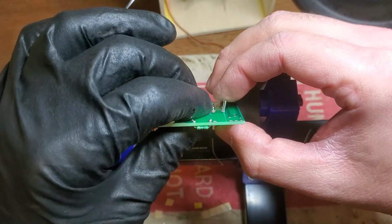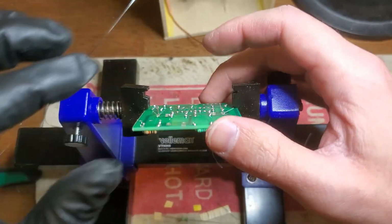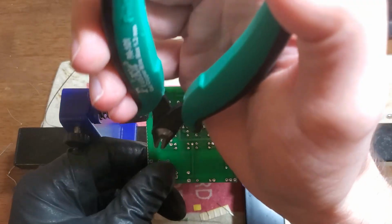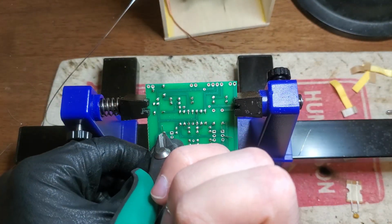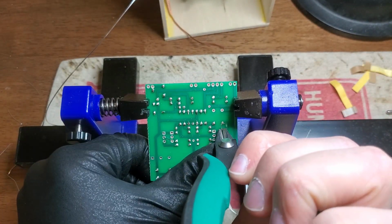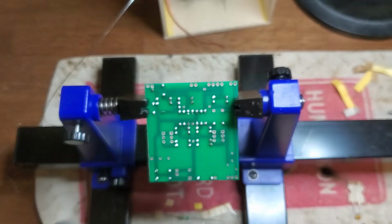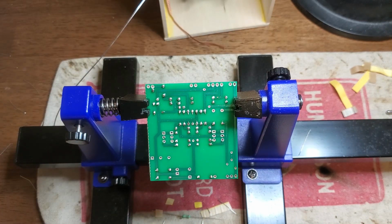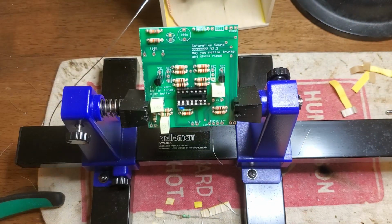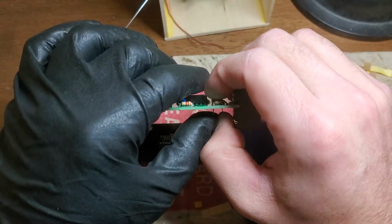It's a fairly gentle cut around 1K, which is pretty high in bass world. Which restores a little bit of rising and falling edge to the input signal and gives the wavefolding network something to bite into, to work its magic on. So if for whatever reason you're trying to play super quiet so it doesn't fold, you will notice a darkening of your input signal. But the idea is that you get that treble information back as you go through the wavefolding.